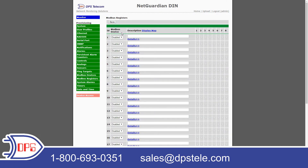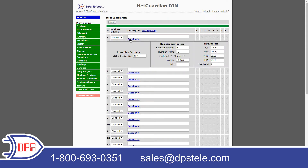Going back to Registers, I'll go ahead and set this to my Device 1 and expand the details field. The first thing I'll do is fill out what I want to call this value — what value am I going to be pulling out of this register? For this example, I'm going to pretend I'm pulling out a fuel level. Then I'll set up what register I'm going to pull — register number 23.